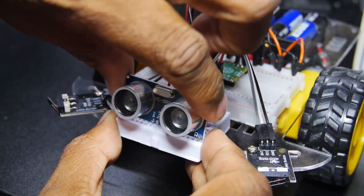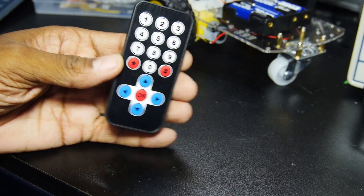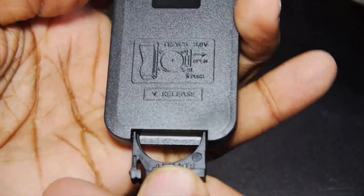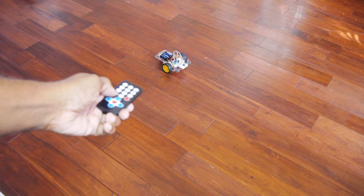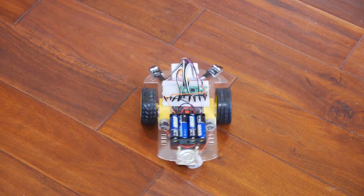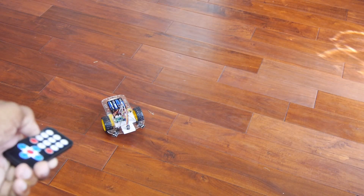I had to try one more lesson — this time with an infrared control. You get a neat little remote controller with membrane keys, but you'll have to supply your own coin battery. It worked, though I could tell I was occasionally getting an intermittent signal — quite glitchy when facing away. I bent the receiver module back a bit, which seemed to help the reception noticeably.